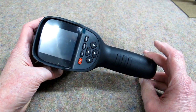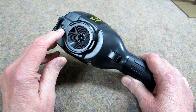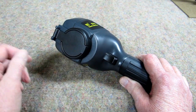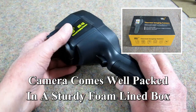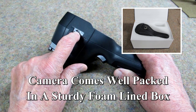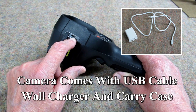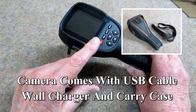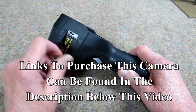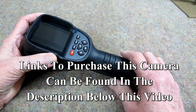The HT18 Thermal Imaging Camera is nicely compact and has a dust cover over the lenses. This is the visible light camera and this is the infrared camera. When you're not using it, keep that cover closed to help keep those lenses clean. On the side is a port and it comes with a cable — plug it into the USB port on your computer or a wall charger to charge the unit. If the unit is turned on, you can retrieve images stored on the internal memory. This key is used for taking pictures, and it has a built-in rechargeable battery.